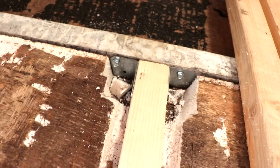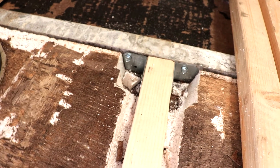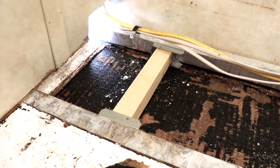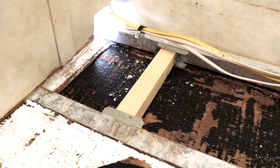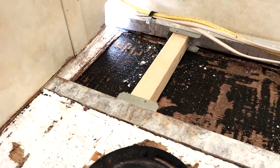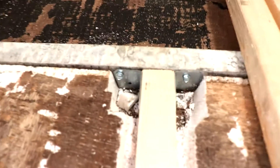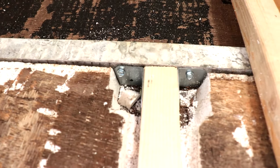That's perfect for installing flooring. This wood that's going on is really thin, so even if one of those flanges is sticking out a sixteenth of an inch or less, you're gonna see it in the subfloor and I don't want that. That's why I bought these other clips — they seem to be working a lot better.